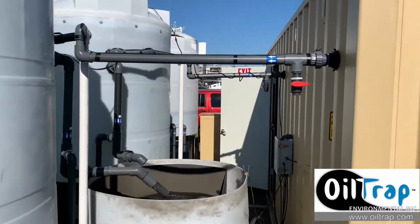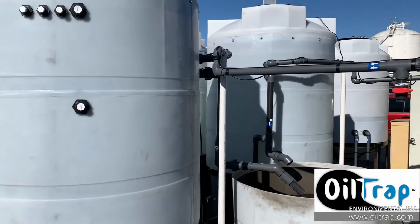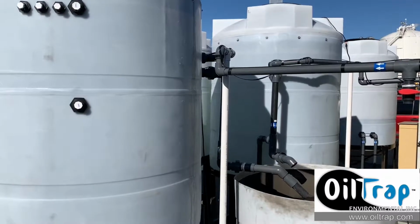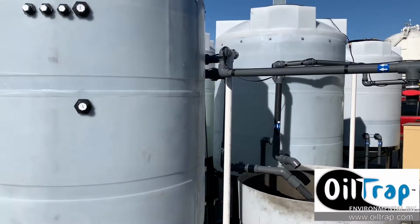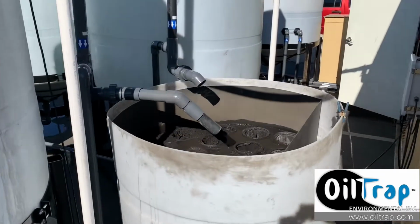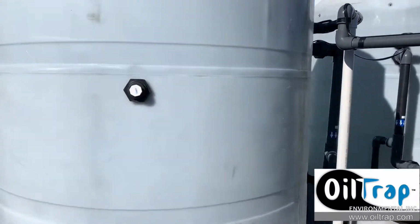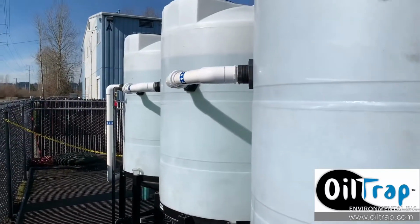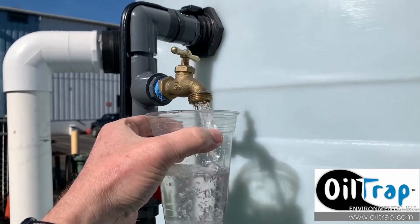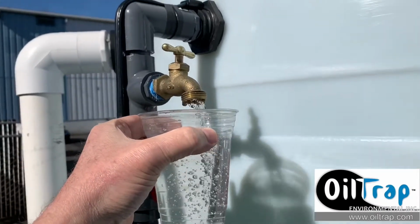Energized water flows into the two separators at 30 gallons per minute each. The solids float to the surface where they are swept off and deposited into the sludge dewater tank. The solids will continue to solidify through this dewater process. The clear phase cascades into the remaining two tanks for added clarity and is discharged. Clean water is then discharged after the removal of the solids, heavy metals, oil and grease, and organics.